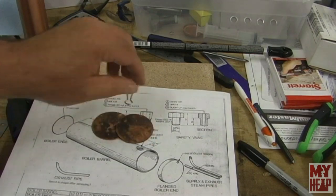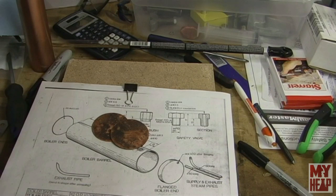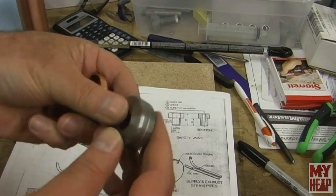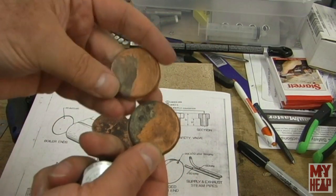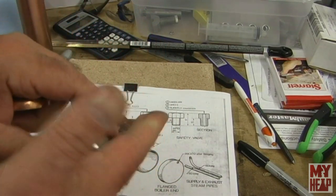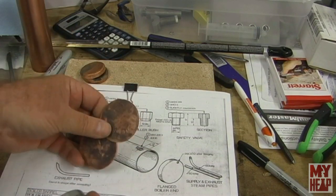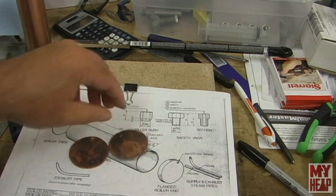In order to form the little cups I made a forming tool. I have a couple of practice pieces done with scraps — you can tell they're scrap because they have soft solder on them that can't be removed. I was able to use the form to pressure-turn them on the lathe, but we'll get to that in a minute. These copper discs have already been annealed so they're soft. Let me get set up in the vise and we'll start forming some boiler ends.